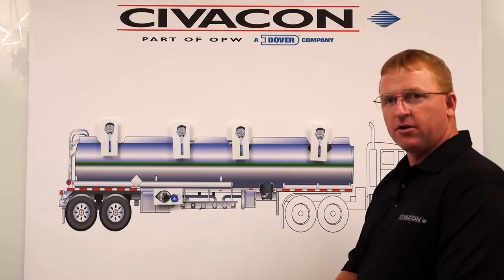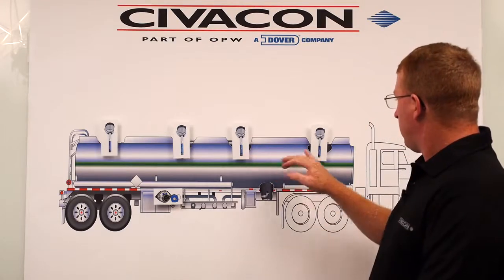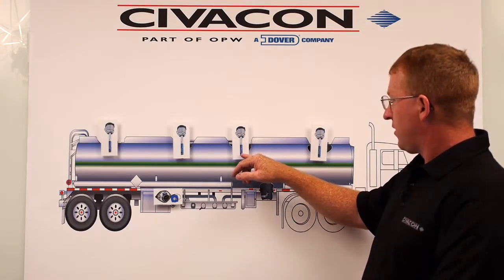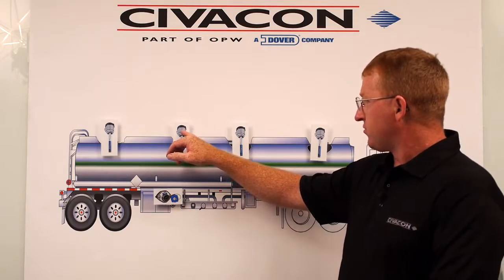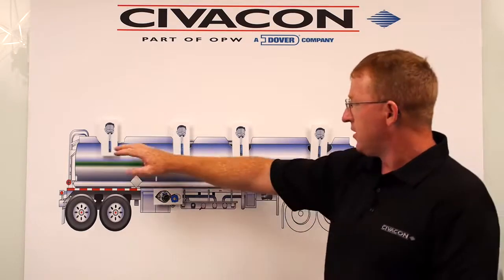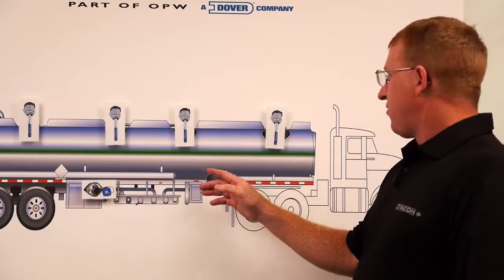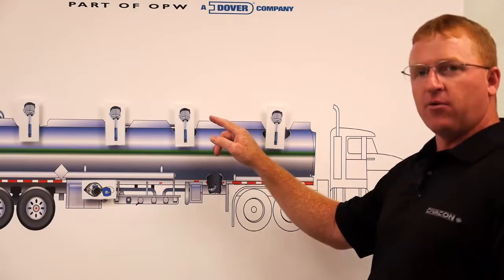With our truck tester hooked up, it's showing us that number two sensor is potentially the issue with our system. That's telling us that number one probe is fine. The issue could either be with a wet sensor or a wiring issue, and the wiring issue doesn't exactly have to be in the number two housing. Remember, the wiring starts at the rear — in a four-compartment unit it'll come in number four, connect to number three, and then number two. So any one of these points could potentially be the wiring issue. A less likely culprit would be the wiring between number one and two probes, in which case it would have to be the orange wire.